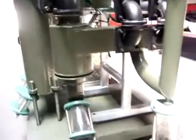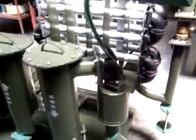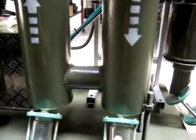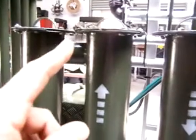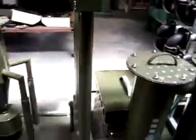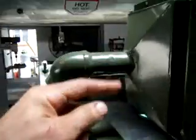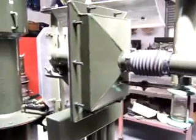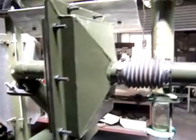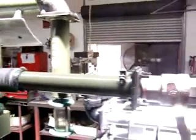The expansion tubes loop all the way down, empty out, then merge back into one. From there there's a mini cyclone with a collection can at the bottom, then into the first filter can which has steel wool in it. There's a little section to collect moisture, then it goes up to the next filter can, comes down into the next one, and goes across to the radiator. It goes diagonally across the radiator and up the back, then comes through into a screen filter — an auto coupling air filter housing with a very fine metal screen inside, with a rubber gasket I made.